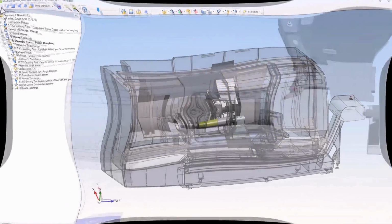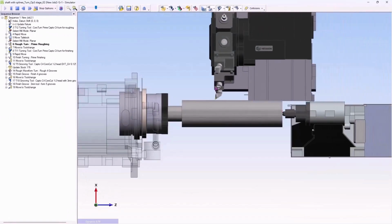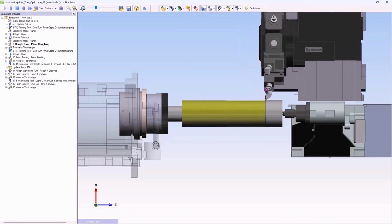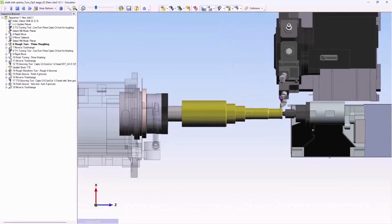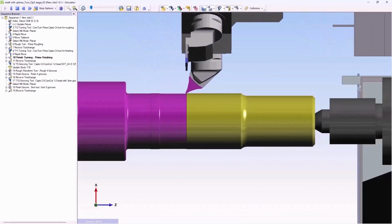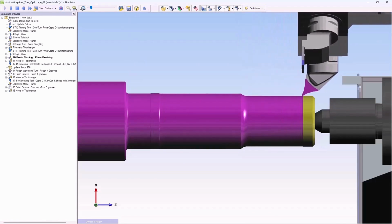Here we see the machining simulation of a shaft. There's been turning work done to put in centering holes as well as turn the chuck end, and then we see heavy roughing being done once the tailstock is engaged in the centering hole. At the conclusion of heavy roughing, we'll bring in a finished turning tool to turn in the shaft, including some slight undercut areas where grooving technically isn't required with a grooving tool.